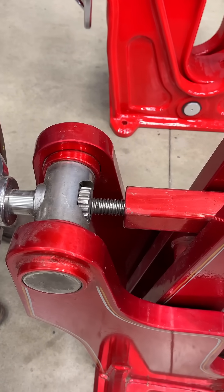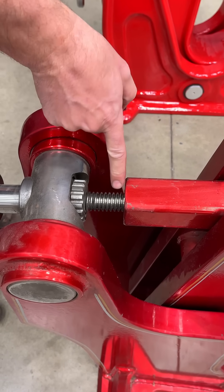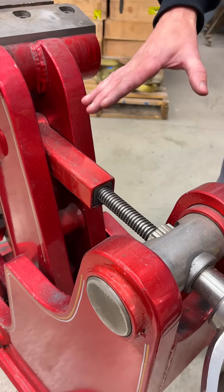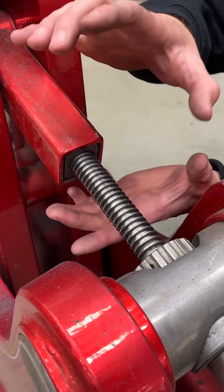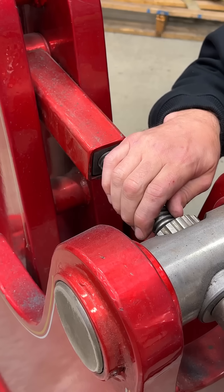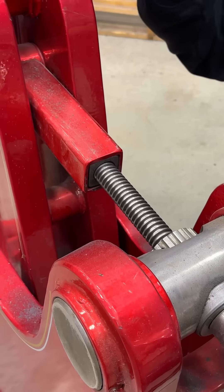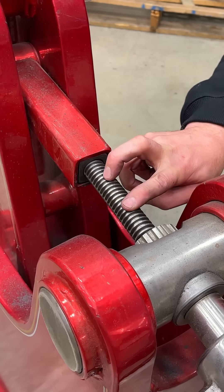Other things I noticed with this vise: I went for maximum clamping force, so I used a one-inch threaded rod. You're probably wondering why this screw isn't something big and honky like four inches in diameter, and the simple answer is safety. If we put a big three or four inch screw in here that won't bend or break, all that does is transfer energy into something else that could be dangerous. Any good design has a simple failure point. All of these components are replaceable. If there were excessive force on the jaws, I'd rather have the screw bend than have somebody get physically injured.